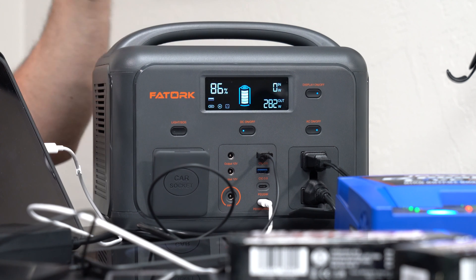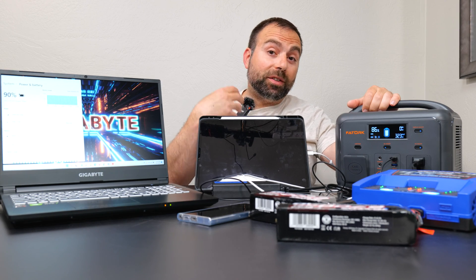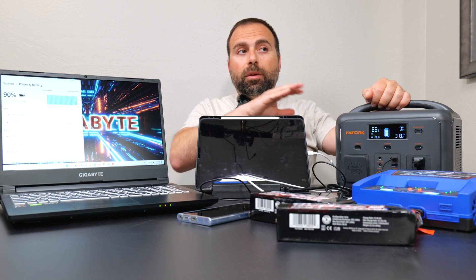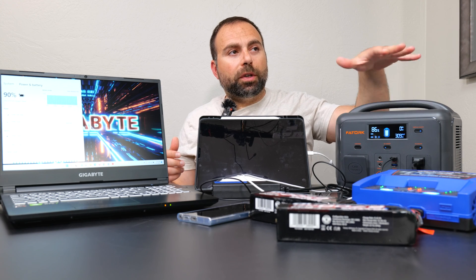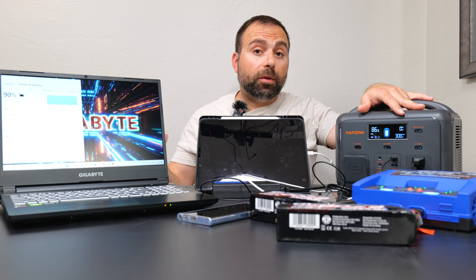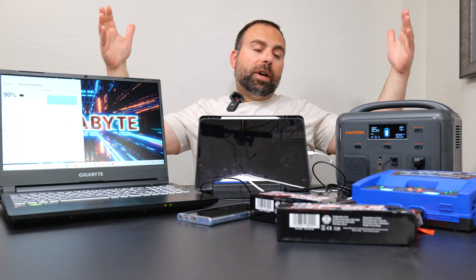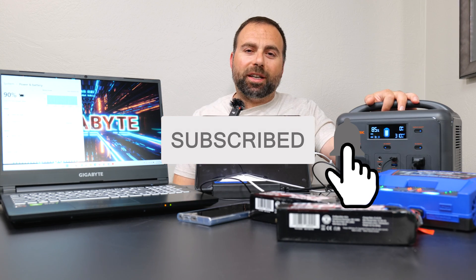If you're thinking about charging power tool batteries — a lot of the ones I have can be charged with this because they take less than 500 watts. But running a power tool directly from this probably won't work, since most power tools take more than 500 watts. So if you just want to charge batteries — like DeWalt 20-volt, Milwaukee 18-volt, Makita 18-volt — this should be fine for that. Anyways, this thing is awesome! Let me know what you think in the comments below, and as always smash that subscribe button — I'll catch you guys in the next one.